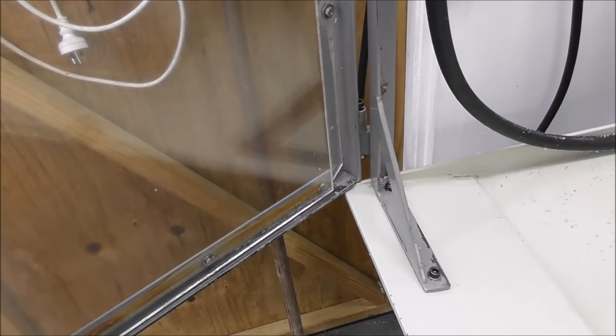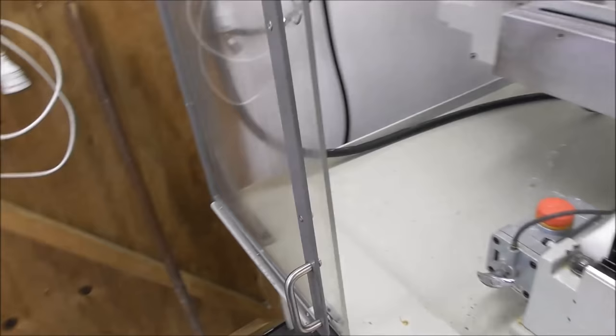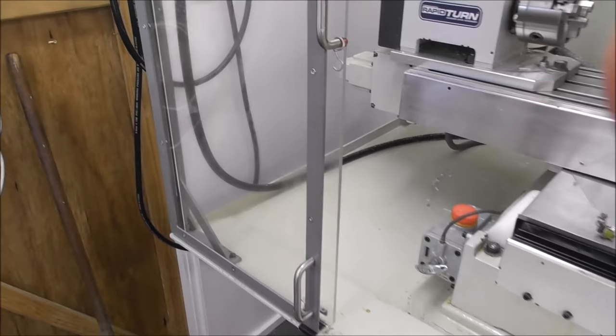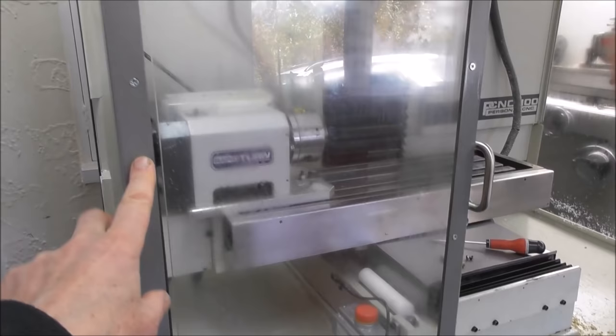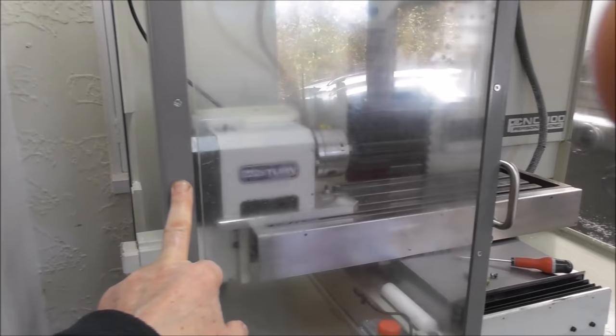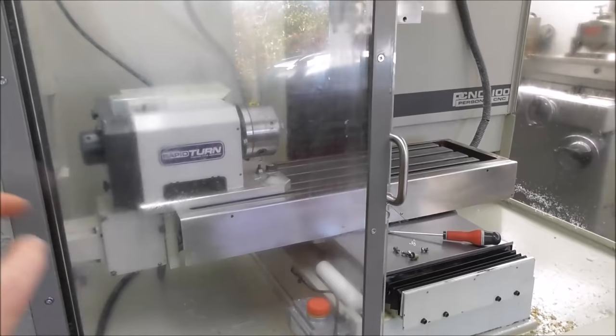Well, while I'm thinking of it, for those of you who want to get on with building, there's a couple of key dimensions I'm not sure I mentioned. It's basically constructed out of what we call angle iron here. In America, where probably the main number of viewers are, this would be inch by inch by 1/8, or in metric, it's 25 by 25 by 3. That's the main section there.